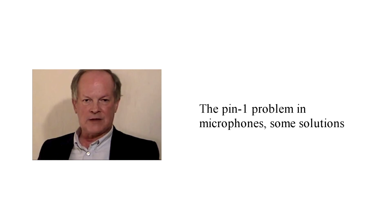And there's another thing you can do. Neutrik has come out with a line of connectors, both male and female, that have a very sexy combination ferrite and capacitive bypass right inside the connector. I can't recall the product name right now, but it's gotten quite a lot of press. If you have a high RF situation, those things are terrific for getting rid of it. All you do is make up some 6-inch jumpers with that newfangled plug on the microphone side of things, and most of the time that'll stop it.